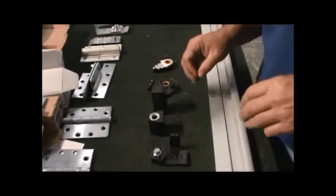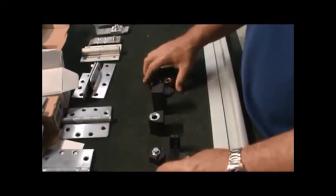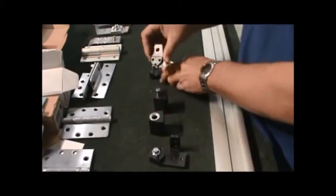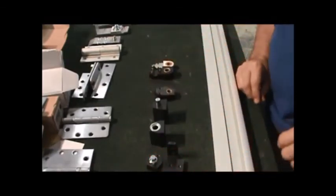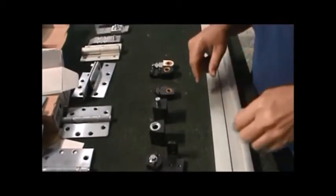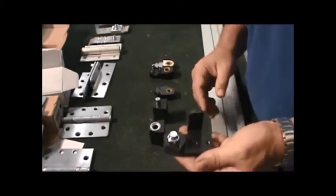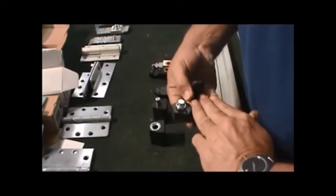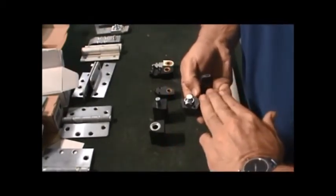So we're going to give you a quick demonstration on a door pivot. In case you came into this not sure exactly what a door pivot does and how it operates, this will give you a quick demonstration. There are 4 parts to a standard door pivot. There can be an intermediate pivot as well, but we're not going to be showing you one. This right here would be the door bottom, and this goes underneath this, inside the storefront itself, and the threshold goes over here. So all you'll see sticking out is this nub right there, right next to the threshold.